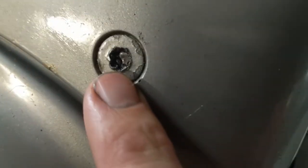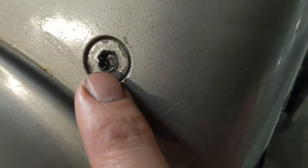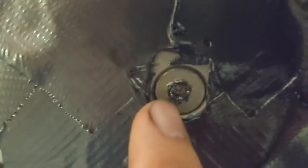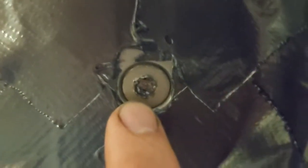I got one out over here and went out over there earlier, as well as pretty much the whole side. This one will be for a later day — as you can see, in the middle of this I broke an easy-out bit into the middle of it, so that's going to have to be drilled out with a diamond tip drill bit or tungsten carbide bit. This one as well — the easy-out isn't as big and I thought I still had some grip with the torx, but no such luck.